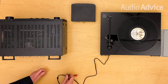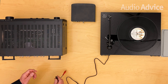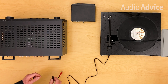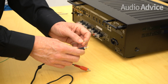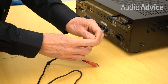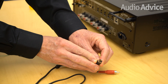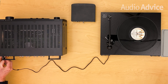The next situation may be where you don't have a Rega phono stage and you're going into an amp or receiver using its phono input or another brand of phono stage. You're going to have to actually attach the ground wire to the left channel audio cable. The Rega cables have little slots in them, so what you want to do is take the wire and just put it under like this, and then since this is the left channel, plug this in to the left channel input.